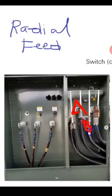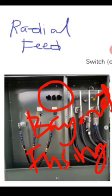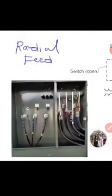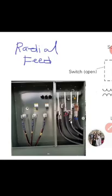For the low voltage side, we have phases A, B, C and neutral — depending on the color coding of course. That's the bayonet fusing there. For pole-mounted transformers in overhead systems, we use power fuses and fuse cutouts, but for pad-mounted transformers we most often use current limiting fuses or bayonet fuses — you just insert them in.